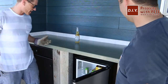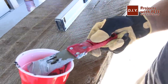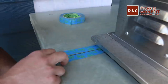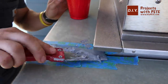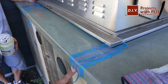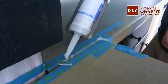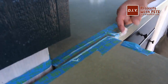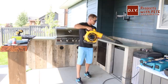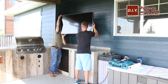We did a quick beer test — put a bottle on there to make sure it doesn't slide off, and we're good! For the outdoor kitchen we filled the seams using 100% silicone, mixing white with black to get a gray color to match the concrete. We taped each seam with painter's tape and filled the seams with silicone. The ends of the short piece of concrete and the rear sides of the left and right grill pieces don't have beveled edges — we specifically didn't put silicone in those areas of the mold so the concrete would be at a perfect 90-degree angle and butt up flush with each piece, minimizing the seam size. We also tried clear silicone for a few other seams and between the slab and reclaimed wood counter. Chris grabbed some barn wood from the garage to trim out the space and act as a backsplash. Some new yard tools made quick work of the cleanup, then we installed a bracket and hung the TV so their family can watch football and sports at the new outdoor kitchen.